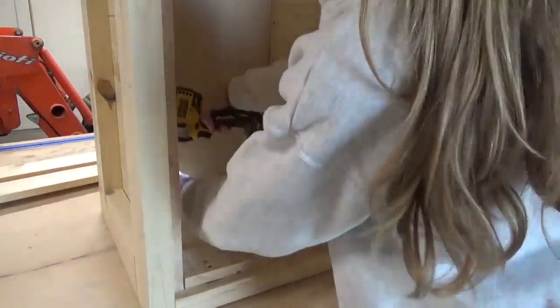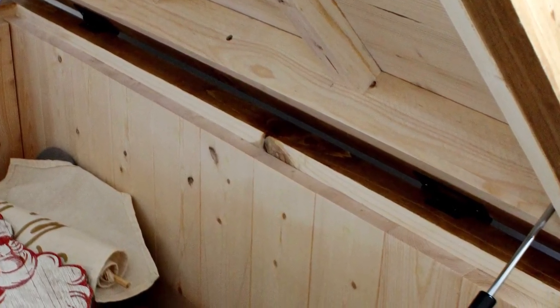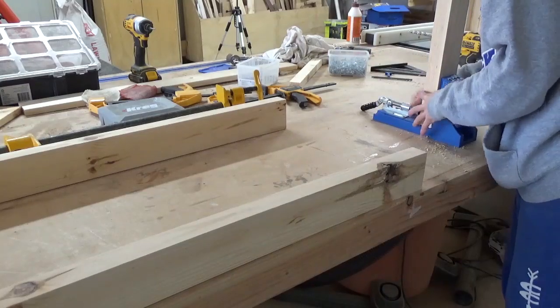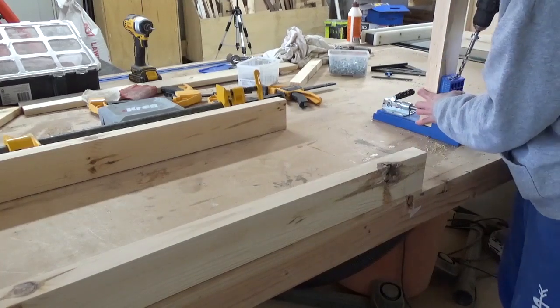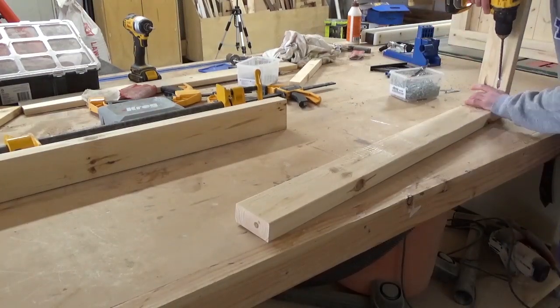Once the slats were in place I set it aside to start building the lid. You may have noticed that when the slats were screwed in there was about a 3/4-inch lip around the top. If you didn't want a big bulky lid, you can totally cut another piece of plywood to fit down into this lip and maybe glue some foam and staple some fabric on it to make it like an upholstered bench top — that way it can lift up to access the inside of the trunk and just sets back down in place. But I opted for an actual wooden lid for this project.